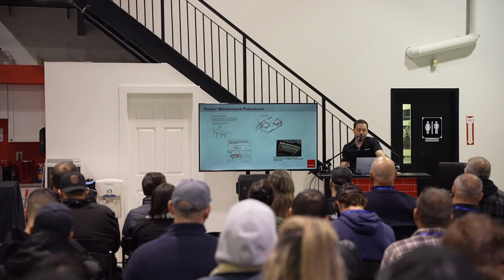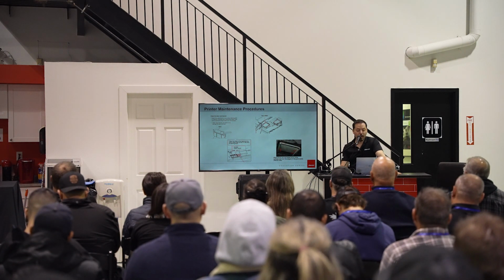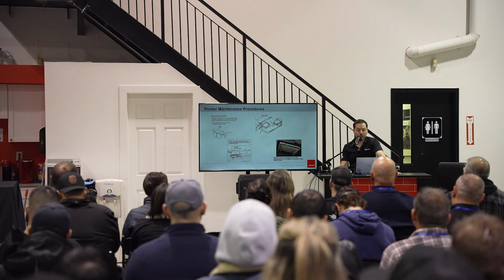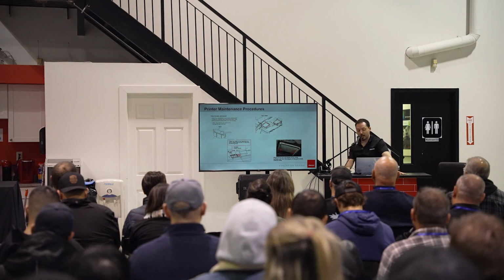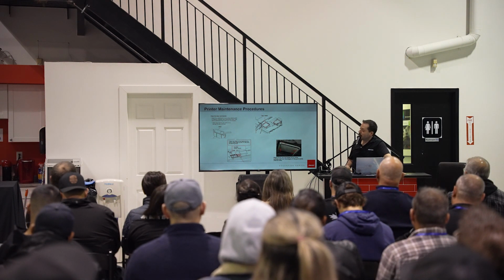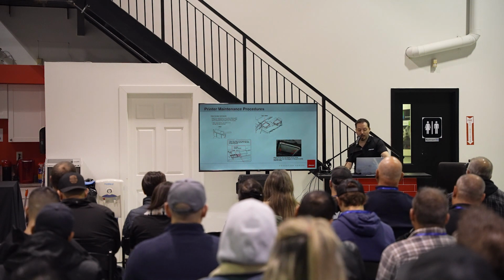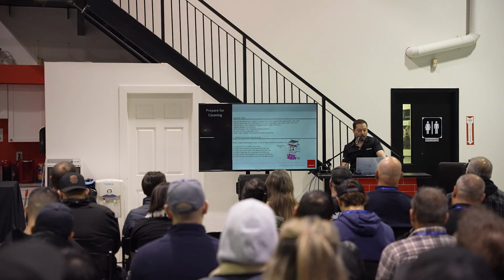And then you've got a slide of where to clean around the printhead. So again, if you have ink left around the printhead, it's not going to create a good seal when it sits on those caps during the purge, and you'll get a lot of nozzle dropout. And last, we've got a picture of a dirty printhead and where you'd want to clean. You can see right here, you've got some ink laying around where those caps would sit. So that's where you're going to be cleaning.